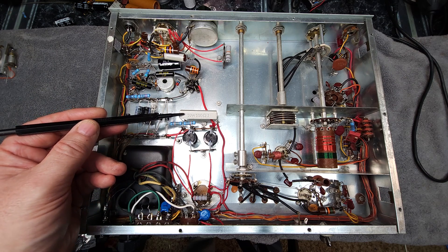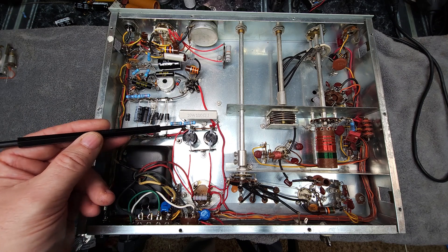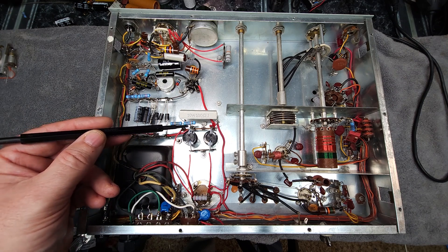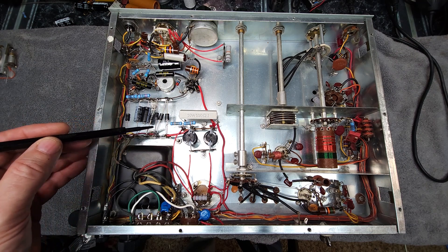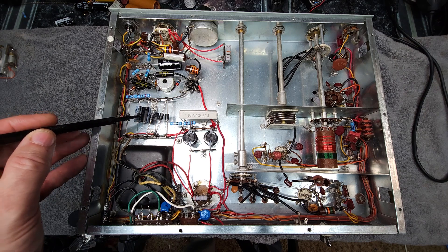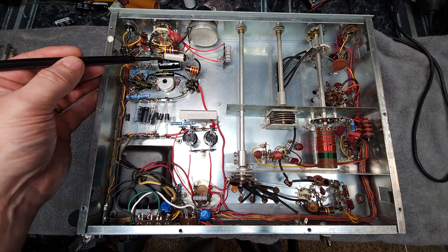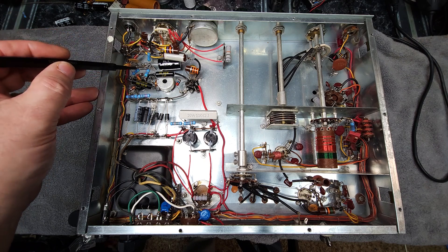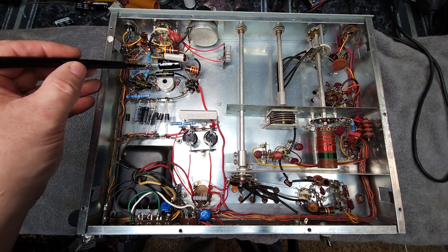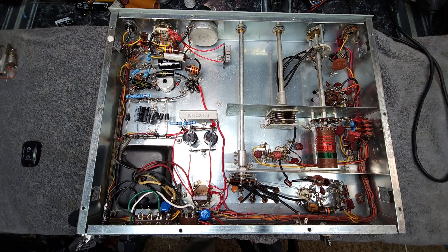I've also replaced one of the power resistors which was way out of spec. I've made an interesting discovery among these two resistors — I'll put a photo up on screen in a minute. All of the diodes are now new. Two more new electrolytic caps and two other resistors were discovered also out of range. Another electrolytic cap was installed, and as I measured resistors around its mounting point, I found that three more were also out of range, so I went ahead and changed those early.